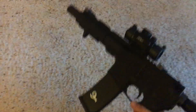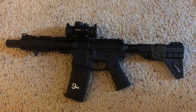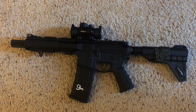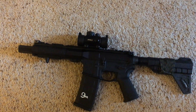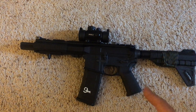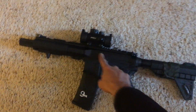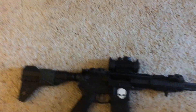I used a standard AR-15 receiver — this is a Palmetto State Armory multi lower, bought stripped. It has a Magpul pistol grip, enhanced Magpul trigger guard, and a standard Magpul 5.56 AR-15 magazine. I'll explain how it's running nine millimeter in a moment. The lower parts kit is just a Palmetto State Armory standard lower receiver parts kit. What makes this probably run more smoothly is the magazine combination with the upper and the buffer tube and spring.